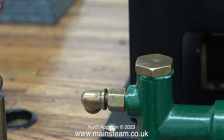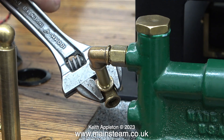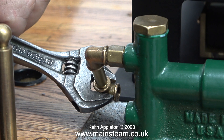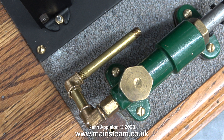This was a fiddly job, and when I think about it I have to do it all again to put the sealant in place. I always try to do jobs properly — the 542 thread sealant will be applied once I make sure that the parts fit perfectly. I don't use these type of pipes on everything; I like the elbows, but I find the thick brass piping only looks good in certain applications, on the exhaust outlets in the smaller range of Stuart Models engines. For the steam inlet piping I will be using 5/32nd or 4mm diameter copper pipe that I can bend to where I need it to be. I think the PM research fittings look quite good on this water pump. I need to put another elbow on the end, then an adapter to fit a standard piece of 5/32nd pipe, which will go through underneath the boiler right next to the burner, coming out at the other end and then going up to the check valve.